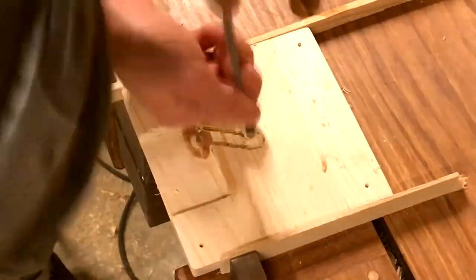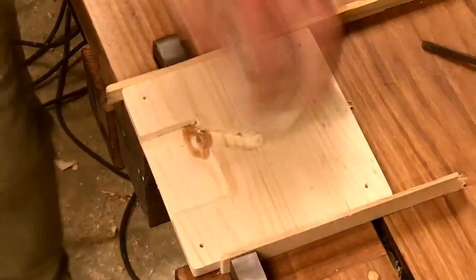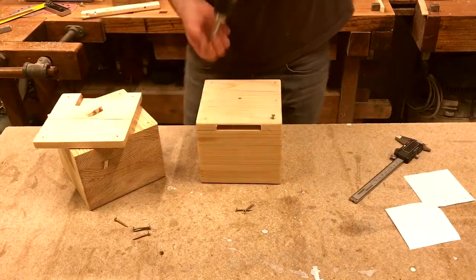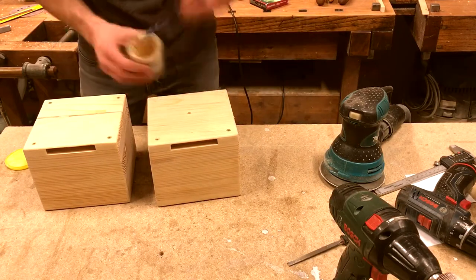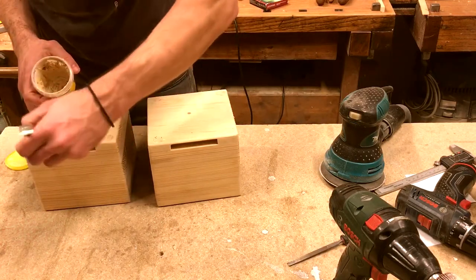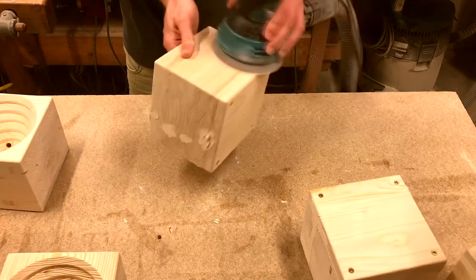And here I use the round chisel to make the way for the sound into the hole of the amplifier as smooth as possible, so that there are no sharp edges on its way out to your ear. Now I will attach the backside of the amplifier back to the cube. And I will mask the screw heads with wood filler, which can be easily removed if necessary. Now the final sanding, after some repairs with the wood filler and before applying the oil finish.